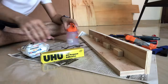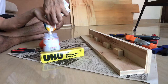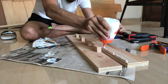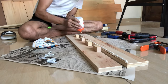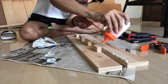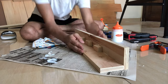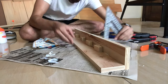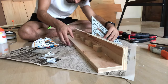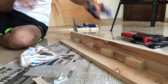I cut some small support blocks to give the fence something to lean on and glue onto. I fill glue into a squeeze bottle — I love doing this, it feels really pleasurable and makes a perfect line. Then I put the two pieces together, apply pressure, and check for 90 degrees with my Swanson square.